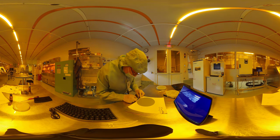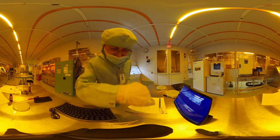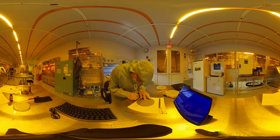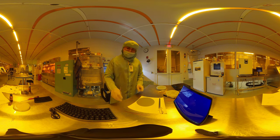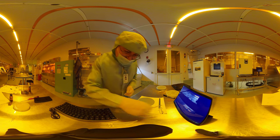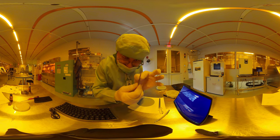Sticking with metric here, I have this about 35 millimeters by 35 millimeters, and that should fit about two inches of a diagonal. I've scribed into it already, so you could hear that scratching sound — I scratch the edge of it with this diamond tip pen.